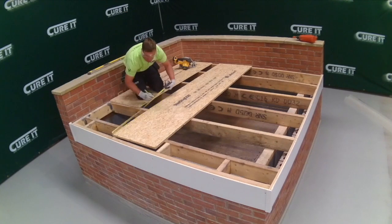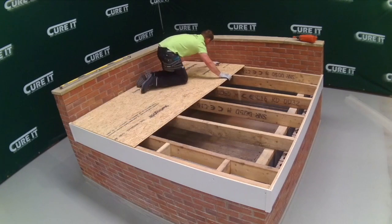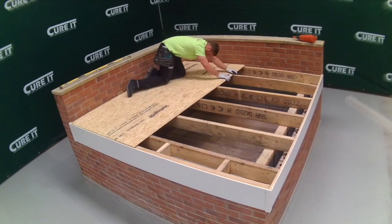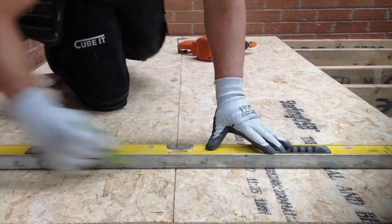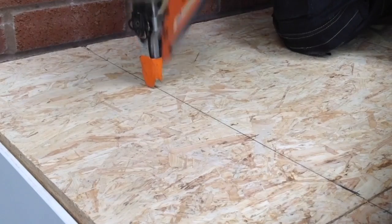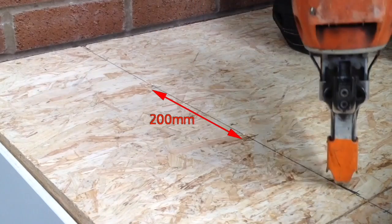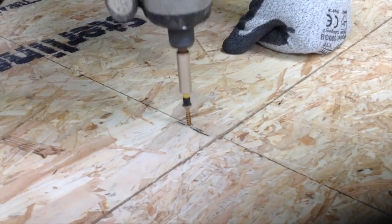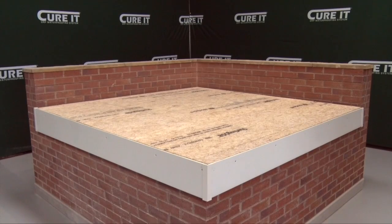Ensure to wear safety gloves when handling boards. Once two runs of boards are laid onto the deck, ensure that they are square to the joists and fix the first run. The boards should be fixed at 200 millimeter centers with four nails or screws across the width of the board following the pencil lines made earlier. Galvanized ring shank nails or screws must be used and must penetrate 40 millimeters into the joist. The decking stage is now complete.